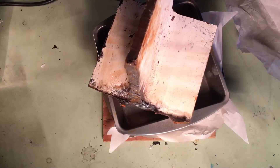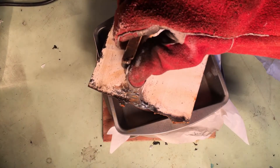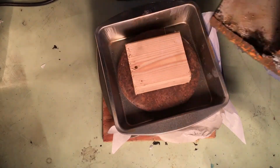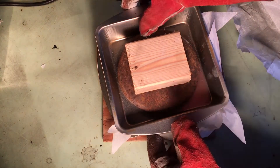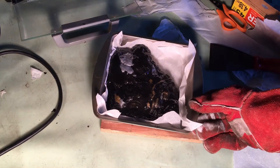Now I'm just trying to work my glob of plastic into the mold to fit uniformly for the final product. Like all the other steps, this is an iterative procedure where I work it until it's cooked to a point where it cannot be worked anymore, then put it back in the oven for about 30 minutes, then bring it out and repeat. Eventually I will have this blob of plastic spread evenly throughout the mold to where I'm satisfied.